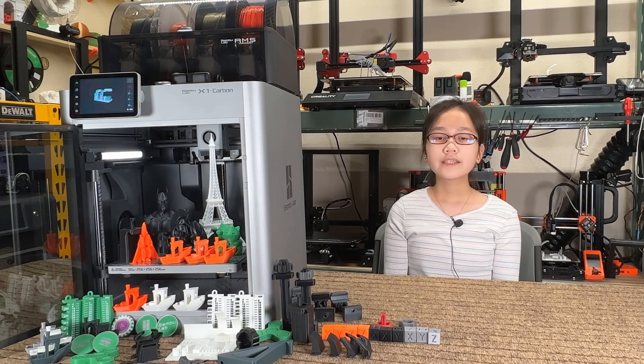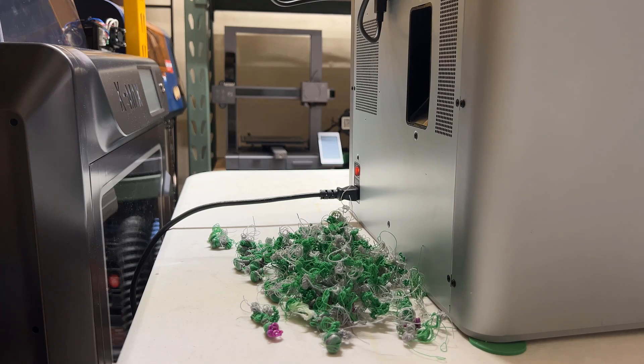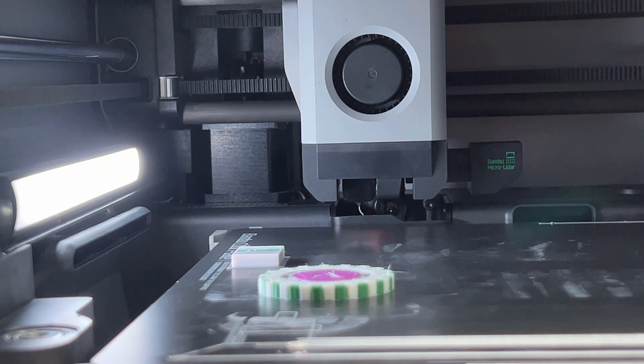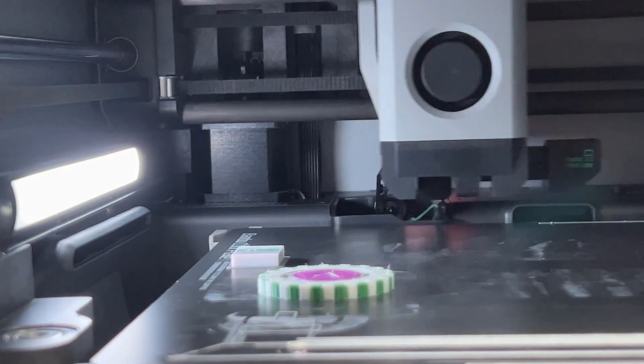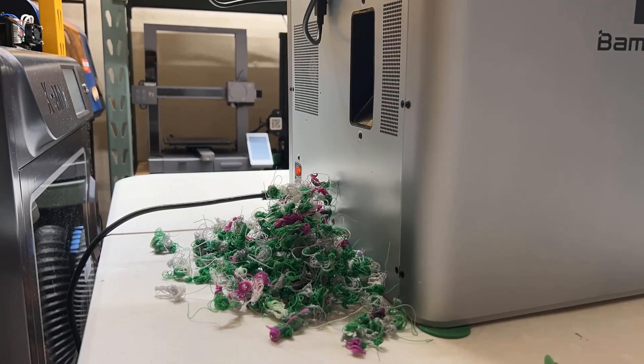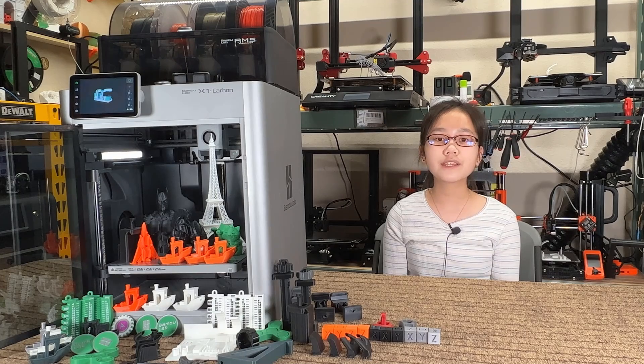Now for the cons. First, the AMS wastes a lot more filament when you compare it to an IDEX printer with a dual extruder or printers with multiple tool heads. As it only has one extruder, when it changes filament it needs to purge a certain amount to make sure the last filament has no residue remaining inside the hotend and nozzle. If you print something small like this multi-color poker chip, the filament wasted would be even more than the actual filament required for the print. It would be better to allow the user to choose the length of filament purged when changing colors, with options like minimum for filament saving, maximum for best printing result, or standard length. This disadvantage applies to all other multiple filament changing systems that use a single extruder.